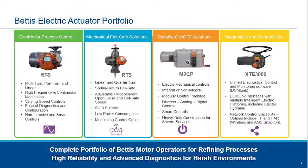Let's review the different electric actuator technologies available for various process and refining applications. For control valves such as sliding stem globes, rotary valves, or damper applications, designs such as the Bettis RTS provide accurate control, continuous duty operation, and a compact design. This design uses a variable frequency controller that allows for adjustable speeds with non-intrusive configuration and advanced diagnostics either locally or remotely. A compact multi-turn version is also available for isolation of small gate and globe valves. The same RTS design can be configured to provide true mechanical fail-safe function for either linear or quarter-turn valves, and is suitable in a SIL 3 environment.